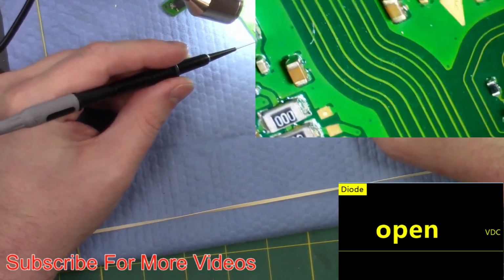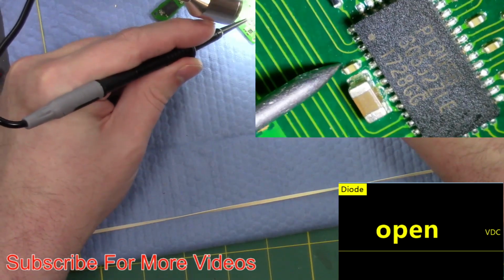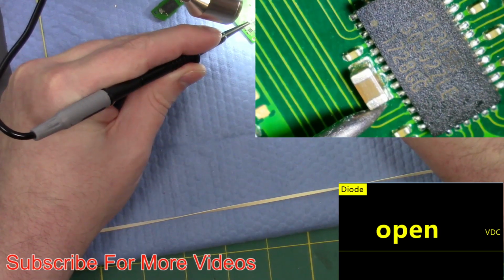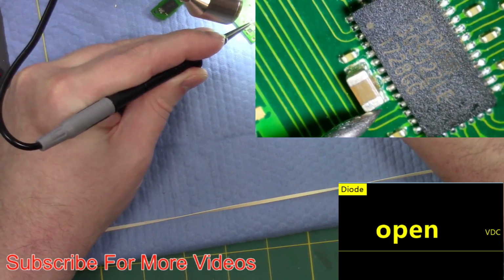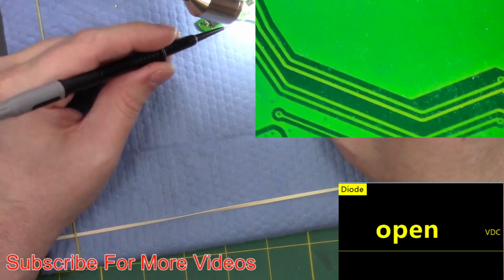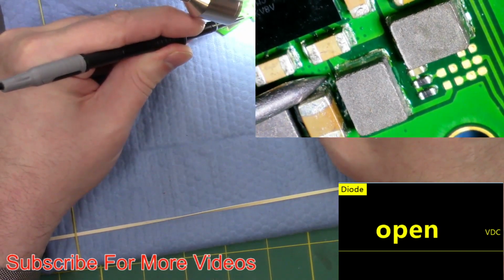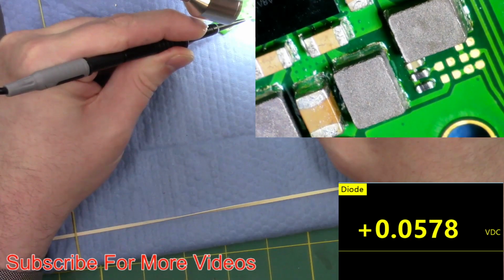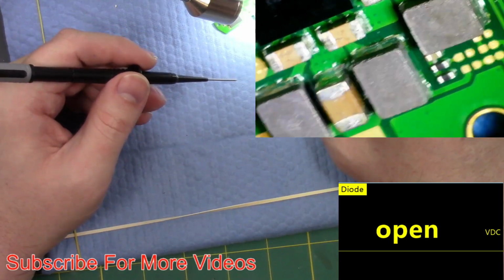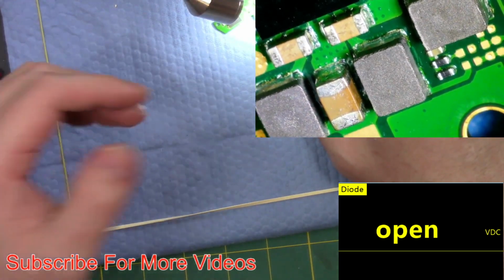Oh, where's it at? I check these capacitors here. Like right there's ground, and there it's open. So if I come back over here to this right here, and I touch that side, see, I still get that same low reading. So I believe, like I said, I don't believe it's the capacitor. Guys, if you think it's the capacitor, let me know.